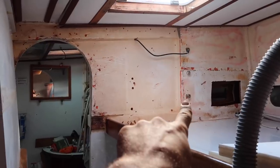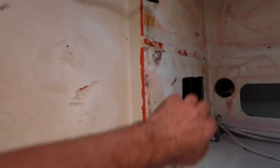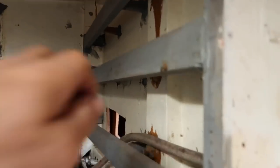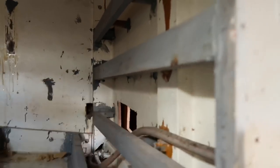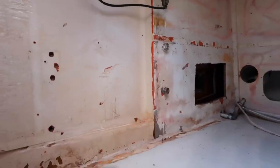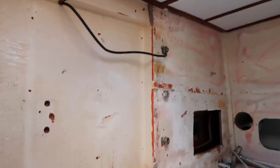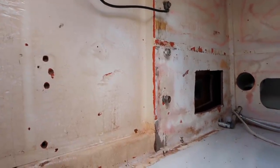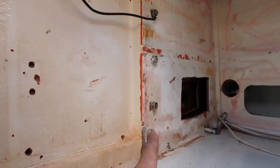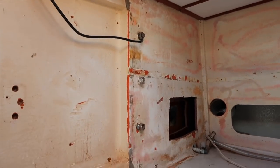This was all wood trim. Those are the chain plate bolts, but I can't even get to the chain plate from that side — you don't see it there — and from this side you don't see it either. The chain plate is sandwiched between these two bulkheads or beams. So hopefully when we're ready to replace it, we can just undo the bolts and slide it straight out. We might also be able to heat up the bolts to melt the epoxy enough to pull it out.